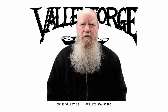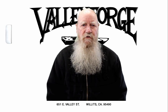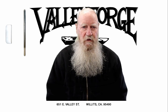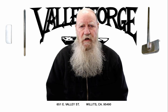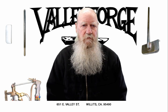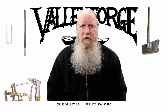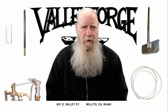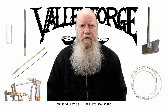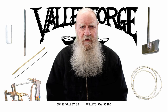So this morning, I have a small job of fixing a small piece of 19 gauge sheet metal to a piece of 3/16th round bar stock, and when I get finished it'll look like this. Since the job doesn't require much strength, what I'm going to use is my oxy-acetylene welding torch and about an 18-inch length of just regular household Romex copper wire. I'll just cut off about an 18-inch length, strip one of the insulated wires out, and that's what I'll be using as filler material.